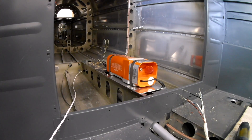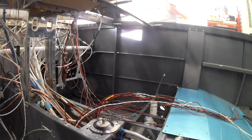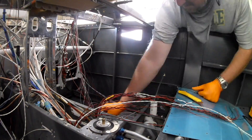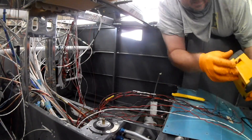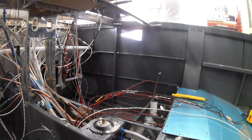Still have to put in the antenna and had to readjust where the slack was on the phone cable. In a later video you'll see me finish that up. In this video, what we're doing is separating the leads and the grounds from all of the power wires in the fuselage. We're labeling some of them, and then working on moving the grounds back towards the grounding block.